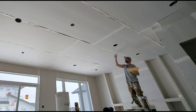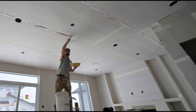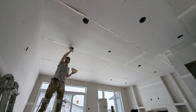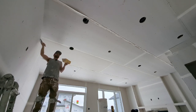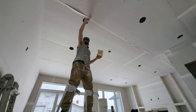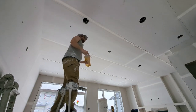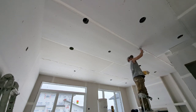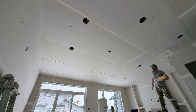Some people who don't understand the tool have raised concerns like, do you get blisters under the tape? Never. I've never got a blister under the tape, and I've been using this tool 12 years now. Well, that depends — if you don't put enough mud behind the tape, the way the tool is set up, sure, it could be possible to get a blister. But you can see that when I'm wiping this tape, mud is spreading out on both sides, and that just means there's plenty of mud behind these tapes.